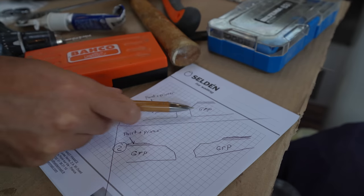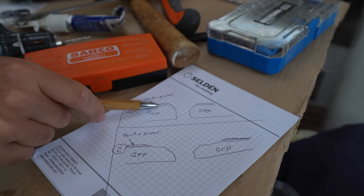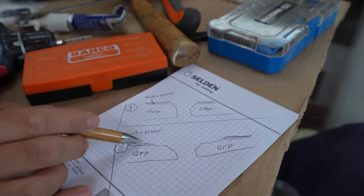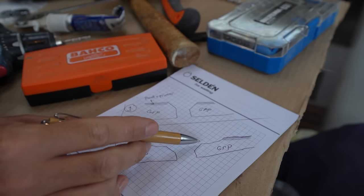It's gonna be raining on and off this week, which makes doing outside repairs like the holes on the cockpit combing just a tiny bit more annoying, but we should still be able to get it done. The holes are tiny so I'm in no way concerned about the strength of the cockpit combing. My main concern is to make sure they're watertight and that we don't over time get little cracks forming around the edge of the holes. This is a cross-section of what the tiny hole looks like — I've put a slight bevel on the edges with a countersink bit. We've got paint, primer, and then fiberglass. My goal is to sand away the paint and the primer and enough of the fiberglass that I can lay up one or two layers of glass without that protruding over the surface, so we have room for a little bit of fairing compound.